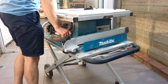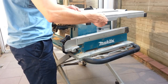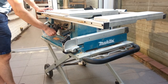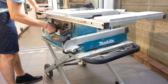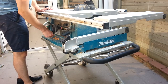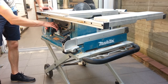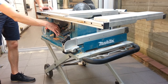The big working surface is one of the biggest advantages of this machine. Thanks to the slide-out side piece you can saw up to 630 millimeters wide. Tweaking the saw depth is pretty straightforward. 260 millimeter saw blades allow for 93 millimeter deep cuts.